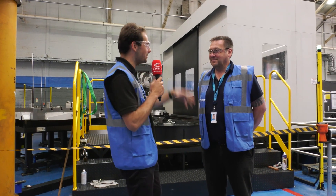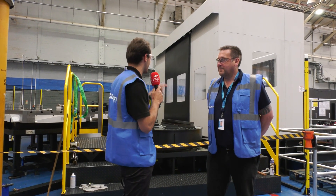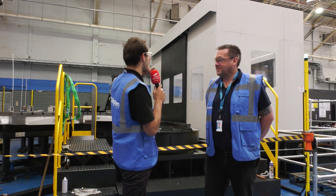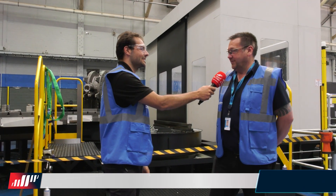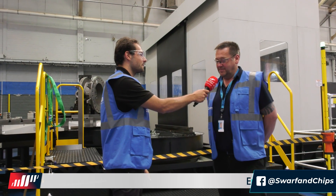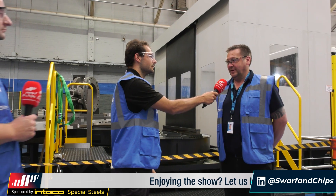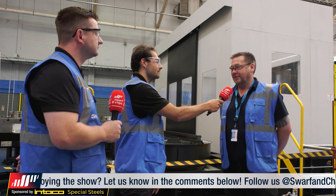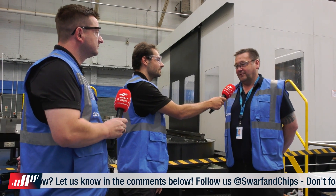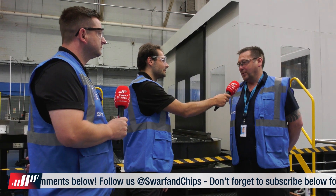Here we've got Paul, head of operations of the machine shop. Congratulations on bringing so many machines and so much engineering knowledge in such a short time. Why did you buy the HNK? Just the versatility of it - everything it gives us. It handles a massive range of valves in our portfolio: globe valves, swing checks, gate bodies, butterflies - everything can go on here. A fantastic machine with four pallets, seven and a half tons of pallet swing, about 2.3 meters.